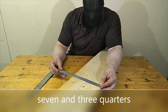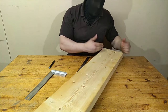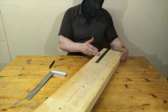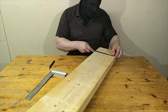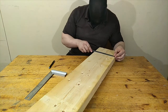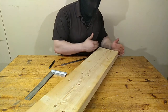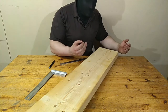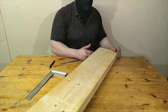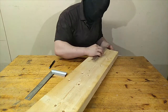So it's not really 8. When we are trying to make a symmetric piece out of it, meaning symmetric in a way that it's as thick as it's tall, we need to make pieces that are, you take the height, the length from the thickness. My thickness was 7 3/4, I guess, or 19.5 centimeters. So that's the principle: as tall as it's thick. But in principle, since these are 2x4s and 2x8s, it should be 8 inches tall also, as it's 8 inches thick, and with the toes the same. Let's continue.